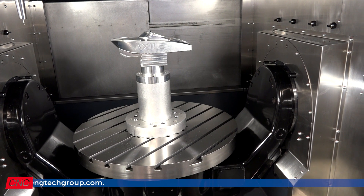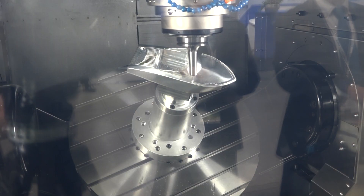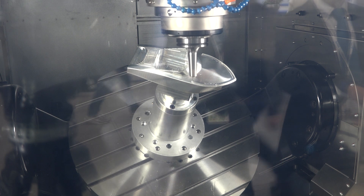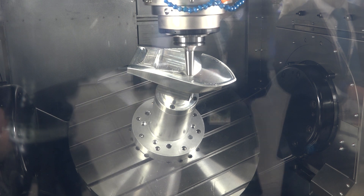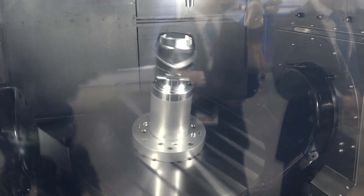So what's the benefit of having motors on both sides? Actually, it gives very good dynamics to the machine — very fast and very good acceleration in the movement, but also high speed. We are talking about 80 RPM on the C-axis and 60 RPM on the A-axis. So you could do some super-fast machining once you combine it with everything else? That's exactly the point.